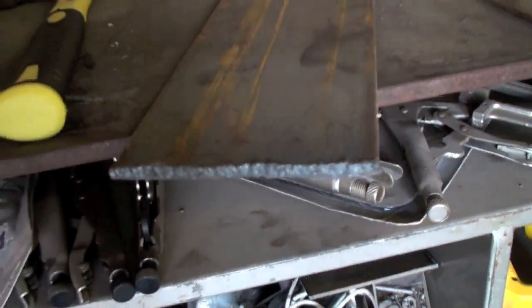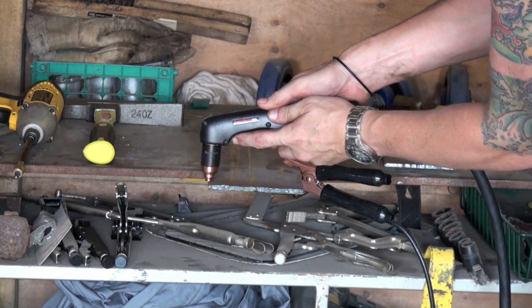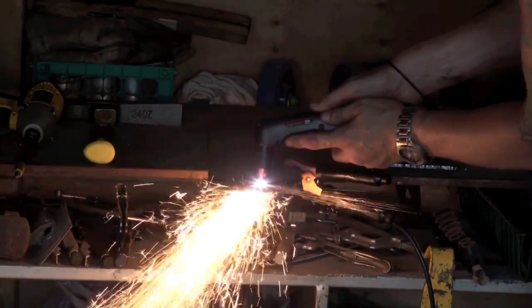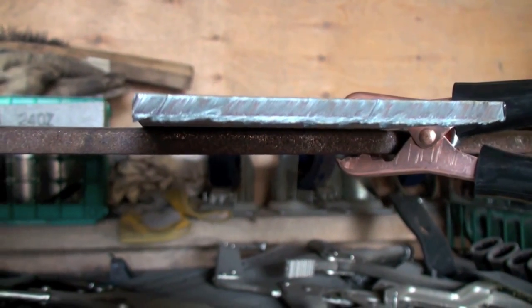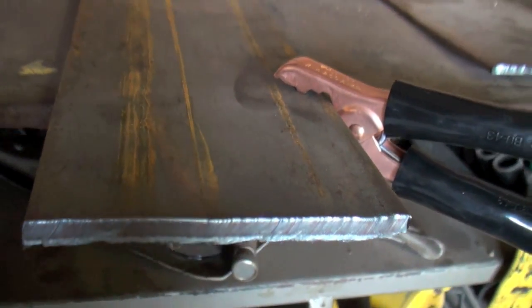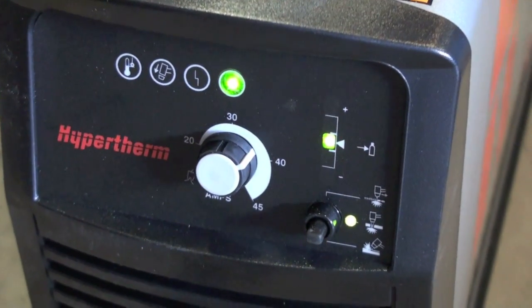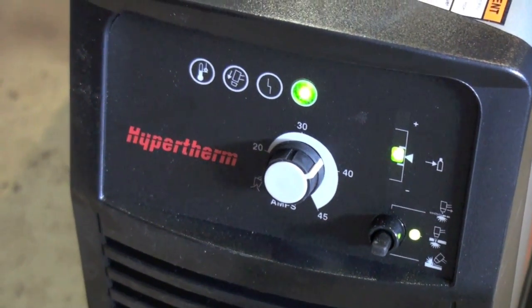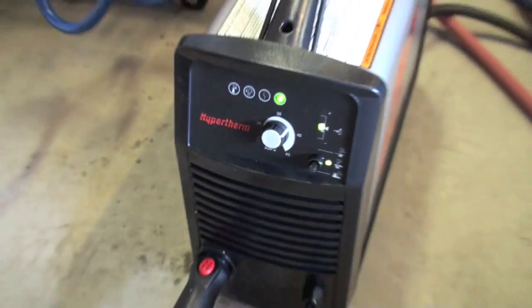Now I'm going to cut some quarter inch — this is true quarter inch. Here is quarter inch with the new plasma cutter. Look at that — just friggin' beauteous. Expensive but worth it. Big time worth it. So that's what I had her set at — probably 37, 38 amps — and it cut quarter inch pretty friggin' quick. And that wasn't even at full volume, so crank that up a little bit and I'm sure she'll perform up to code, man. This thing's awesome, I can't even believe it. I'm friggin' stoked about projects now.